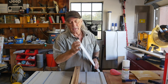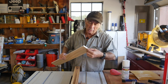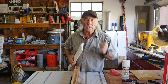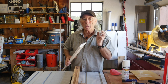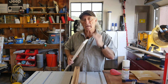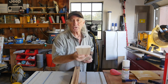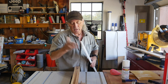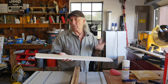The other thing to do is sand your end grains — there's an end grain here, another problem we face with lumber. Sand it really nicely, even if it looks great from the side, because it's not. Sand it with a light sandpaper like 180, 200, 220, or 240. Make sure you sand it because when you paint it, that end grain is going to suck up the paint and look nasty — you'll be painting over and over trying to cover it. A little sanding gives it a smooth finish and the paint will cover the ends nicely. I did not sand this one enough, and at that point it didn't matter because the whole piece was no longer usable. This will go to the scrap pile and I'll reuse the plank for something else.